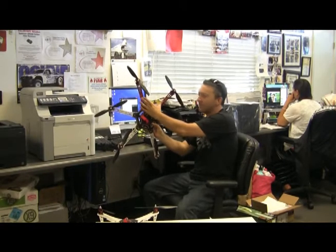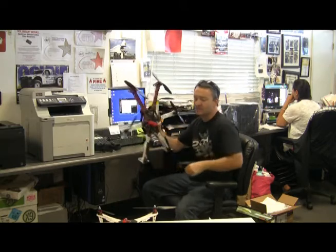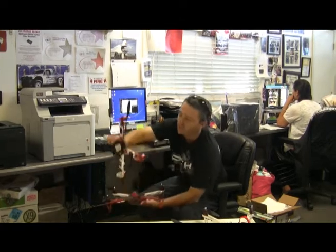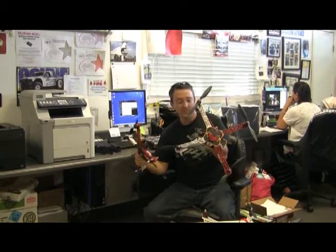On this we have red again as our forward front. If you want to have it as a plus six, that would just be one of the booms. Same as the F550 — if you want a plus four, one boom would be your heading. Now the F550 and the F330 are set up the same. The main difference is size, but the F550 is run off 30-amp ESCs and these are 18-amp, and they do have smaller props — 8-inch props.